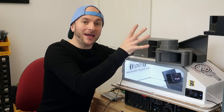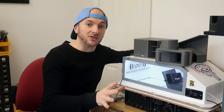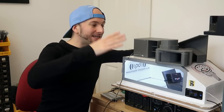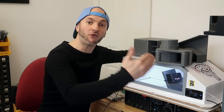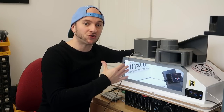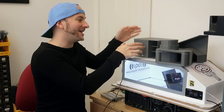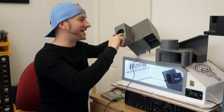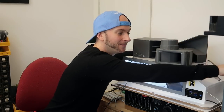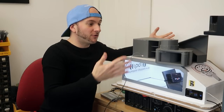And that leans into another interesting scoring method we could do for this season. At the end, once we've got all the results, we'll take every single enclosure that we've tested, even the ones in the bus stats, and we'll do a score for performance versus size. So I'll work out some kind of formula to see the overall performance dB average across the range of frequencies against its size. The winner of that category would have the loudest score relative to its size. That would be another really interesting way to do it because, okay, let's say this is definitely the loudest, but let's say, for example, this wasn't that far off. Having four of these in the same volume size would clearly be louder. Therefore, is this the best enclosure to build? Probably not. You're probably better off building one of the smaller ones and just having more of them, for example.